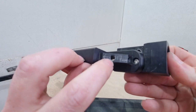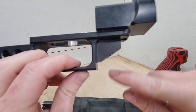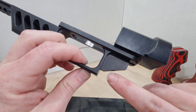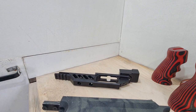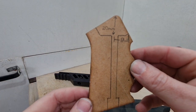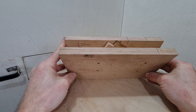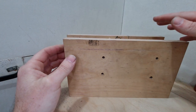Another dimension that's the same across all of these: the position of the fixing bolt hole from the front edge. If you reference from the front edge of the grip to the center of the fixing bolt hole, it's 17mm when you've cut to the correct depth. This lower edge here is 20mm down from the top edge of that radius. When you know that, it simplifies things quite well. I'll pop some photos up at the end so you can copy all the dimensions. I'll also put pictures of the inlet and jig I use. It's quite a straightforward jig — you only need two plywood or MDF boards, whatever you can get your hands on.